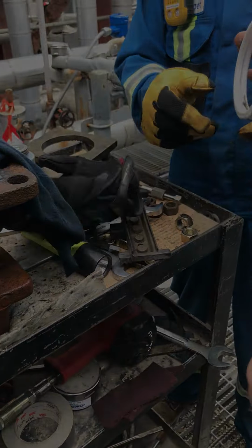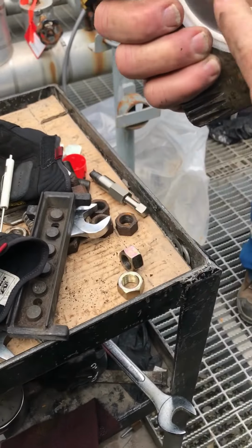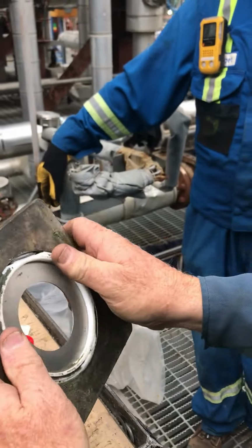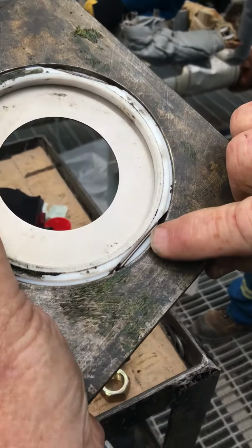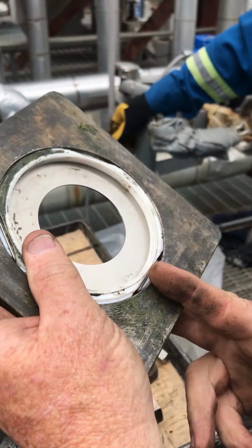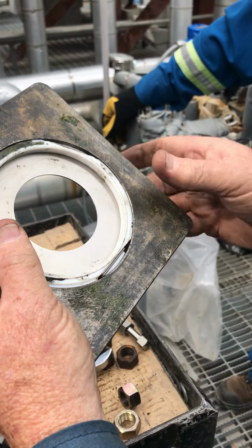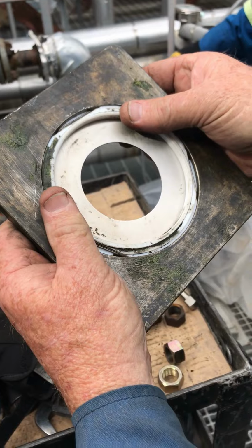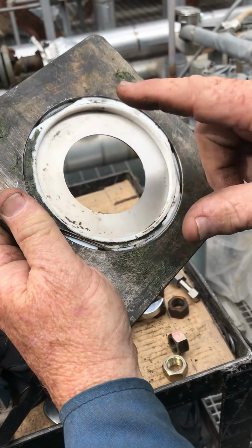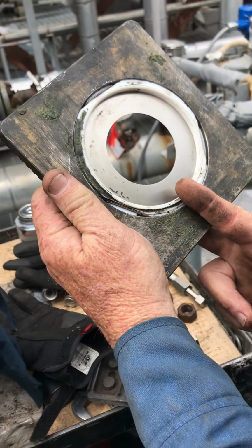Right. Okay? Once you put the plate in, the gears are up and down, top, bottom. Okay? So when you roll her down in, you don't want the fastener at the bottom where it's going to catch on the seal going into the bottom of the fitting. You want to rotate it so that's on a 45. Okay? Doesn't matter about the top. It's the bottom when it goes in so it doesn't catch the Teflon and rip it.